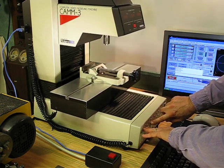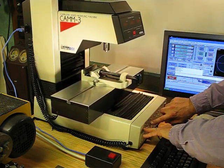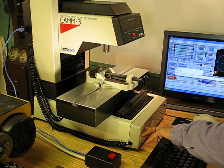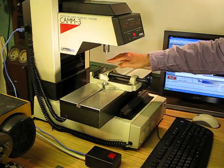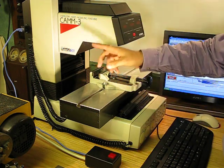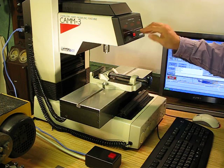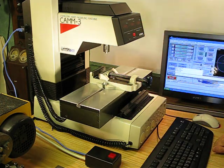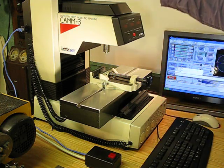I'll move the work area out to the center. Normally I would have a block of wax or soft metal in here, and I would set it up and calibrate the position of the cutter relative to the workpiece. You can use the sensor that comes with the CAM3 to set the height, then reset the display to zero. This is reading in millimeters and hundredths of a millimeter, all under the normal operation of the Z80 controller.